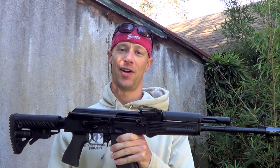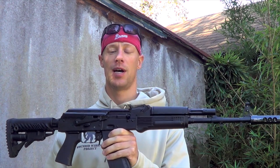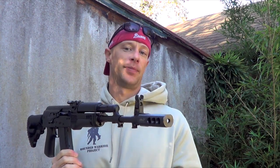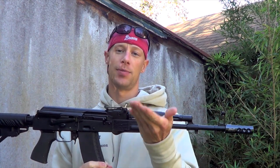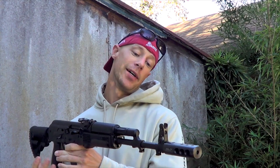One thing I wanted to clarify: earlier in the video I said a one-to-one ballistol/water mix, but I actually use one-to-five, and I know guys that use one-to-ten or even higher. Because the key that really matters is the water. If you're using Windex, that's fine — it's not going to hurt anything. But what's actually dissolving those salts is the water, not the ammonia. I use the ballistol because it helps bring the water off the surface of the gun once it dissolves those salts.